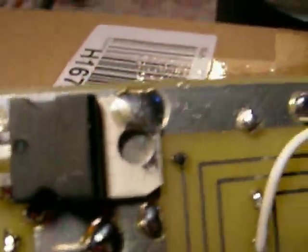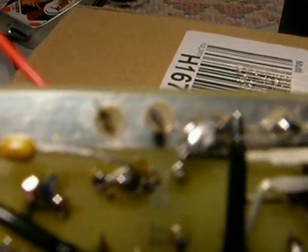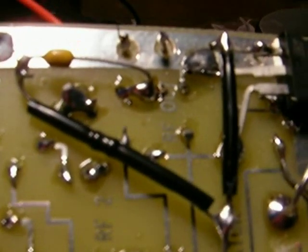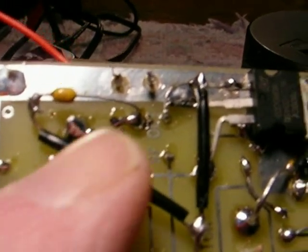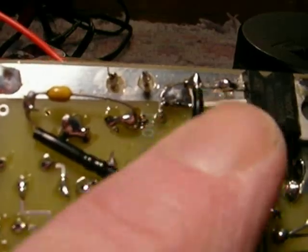Same thing with the added RF components. Make sure there's nothing touching ground on these terminals here, and on this one of the coil — it comes out and joins the regulator.